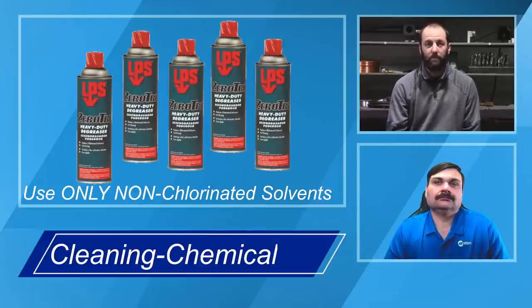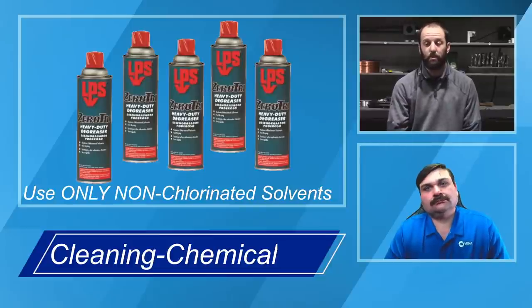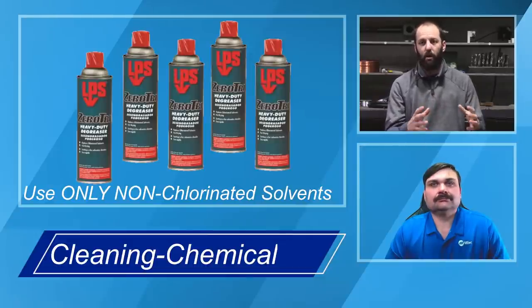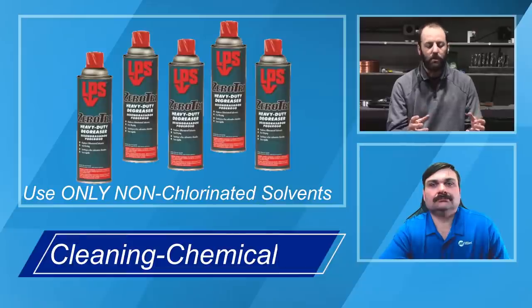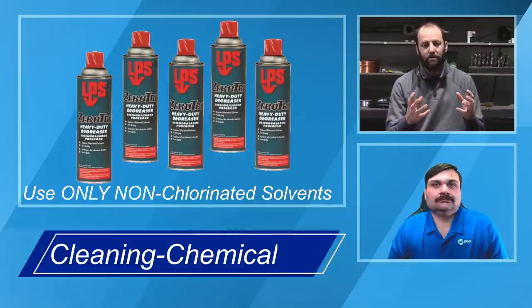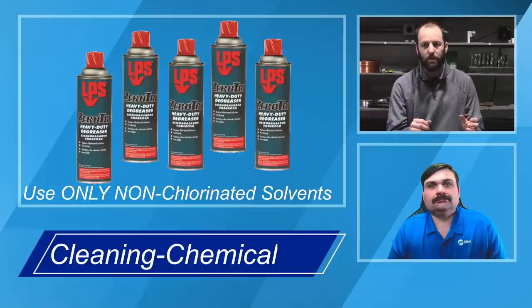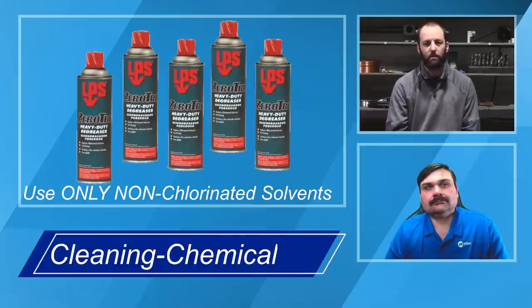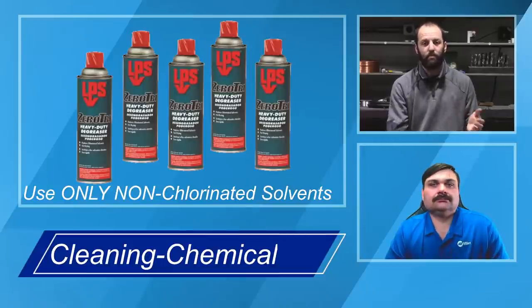I have seen in the past where I've gone into different customer sites, places where they're doing aluminum welding, and they take a component straight out of a machining operation, a turning operation, or a milling operation, and send it down to the weld cell. Ultimately it's the responsibility of the person doing the welding to make sure that all of the material prep is done properly in order to get the best results. And as Travis mentioned, the aluminum has that finger-like structure in the oxide to grab all that contamination. So just taking a rag and wiping off the surface, yes, it's going to get the bulk of it, but there are still a lot of crevices, small microscopic areas where that fluid or hydrocarbon can be trapped. Using a solvent like LPS is going to help float that stuff up to the surface and allow you to wipe it away.